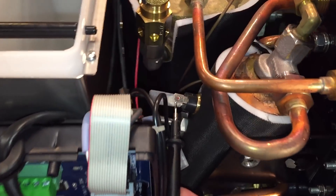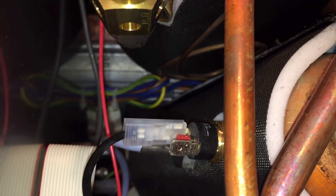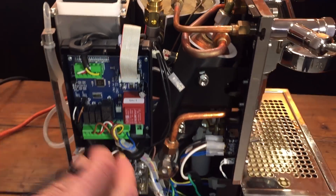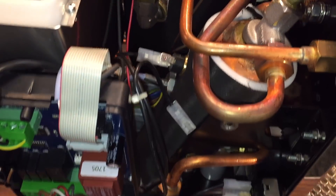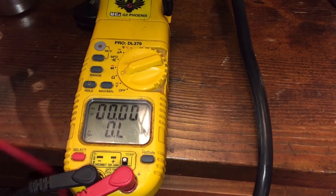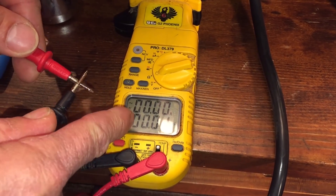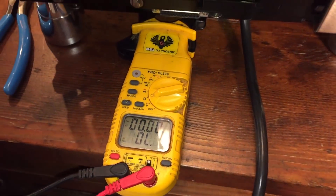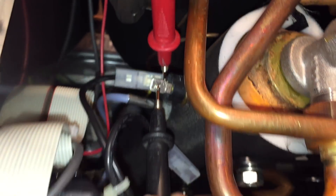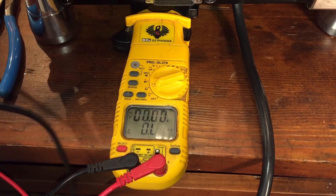First thing you'll do is see that red button in there? That's like the very first thing to check — it's like a circuit breaker sort of deal. If that's popped out, you're not going to heat a boiler; that'll break the power going down to the heating element. So set your meter to ohms, touch your needles together, make sure it's showing no resistance — always check your meter first like that. Then slide it in there where you can touch the metal on that tab, and check the meter — again showing no resistance. When I pull it off, you'll see it shows infinite resistance. So now we know that high limit is fine.